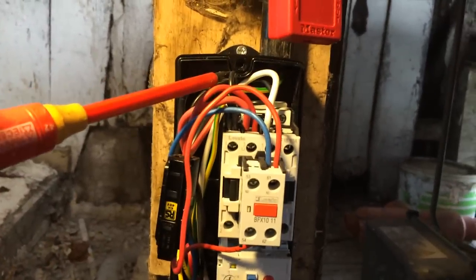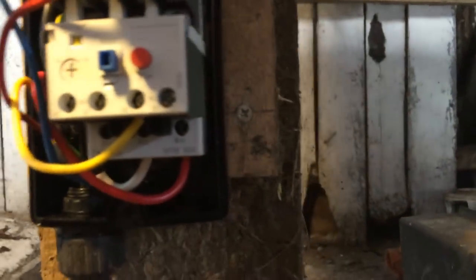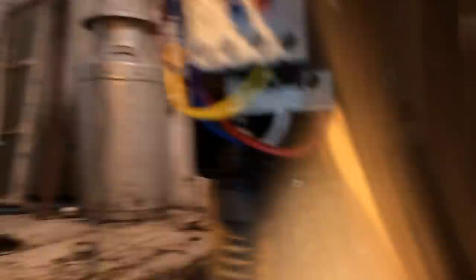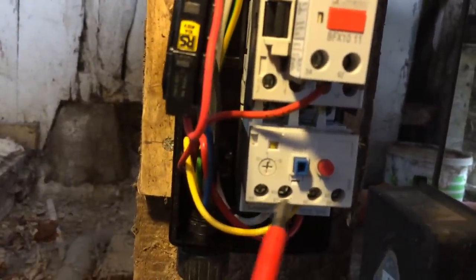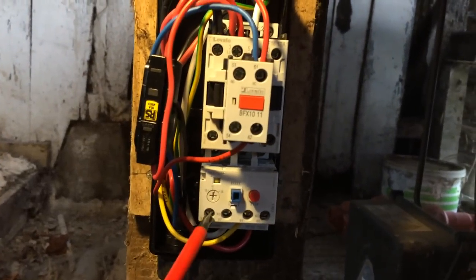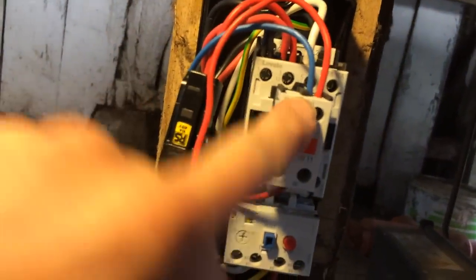That's all wired. The neutral comes in on the black, goes straight to the contactor, through the overloads, and out on the black to the compressor and the fan. Live comes in there, straight through onto that white wire, and then that goes around again, comes through here, and then goes out onto the motor. Because these three poles — these overloads — you need to have current going through each one. It doesn't matter what comes in on the live, it's going to come out on the neutral. So you could link the neutral through, or you can link the live through. Either way it's got to have the same current going through each one of these, or it'll trip. I think it's lost a phase. And then we've got permanent live through a fuse holder, onto here, that goes down to the control circuit, and then that comes back up here through the overloads.